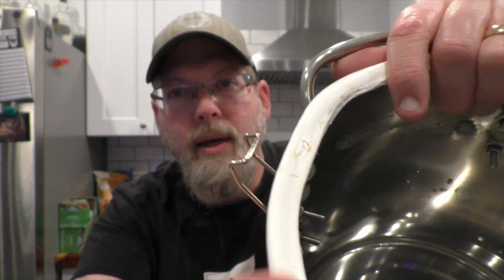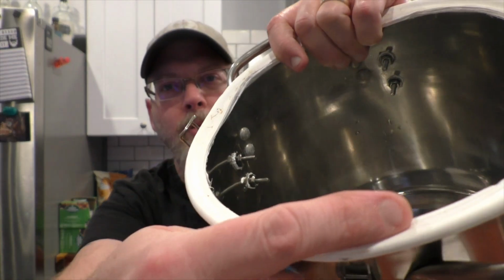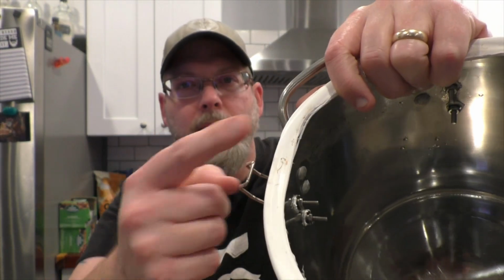When you put it around the rim and then clamp the lid down, you can kind of see that ridge in here. That just forms and it stays there. The frustrating thing about PTFE tape is that it does not melt together. You will not be making a solid contiguous gasket out of this stuff. It will not melt together like normal rubber or normal plastic. You can't do that with this stuff. PTFE doesn't melt, it burns, it chars.